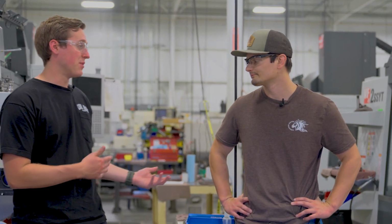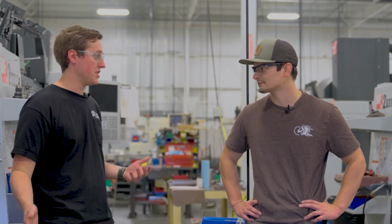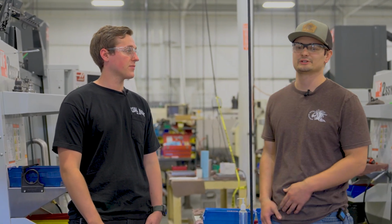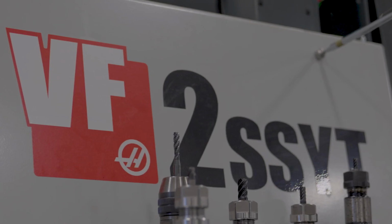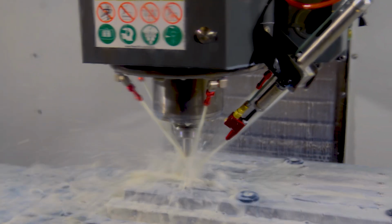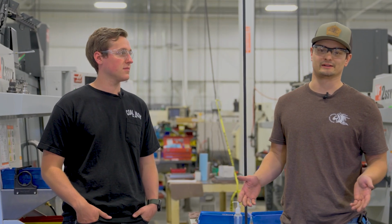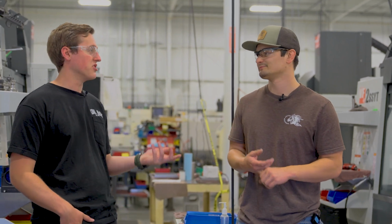So Sam, we just finished up at the water jet where we're cutting out blades and handle frame coupons from your sheet material. So what are we doing now? So now we're standing in front of the machining centers, specifically our Haas mills or VF2s. Basically everything that comes off that water jet, all the coupons are going to have to be milled. And that is where we have to put in the effort in planning, especially for all the different models and all the different grinds we have. All the production scheduling. Yep.